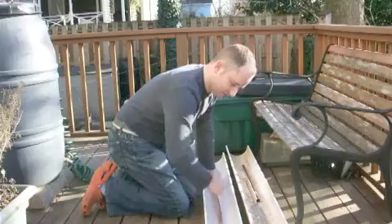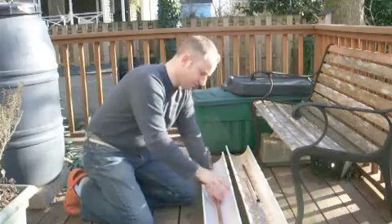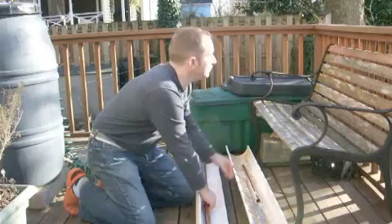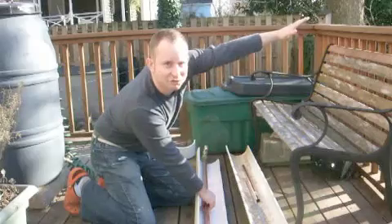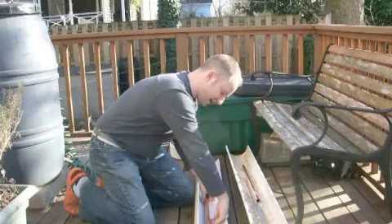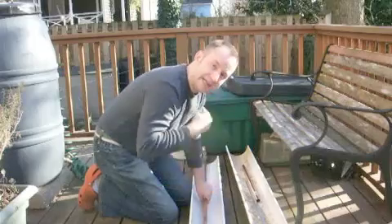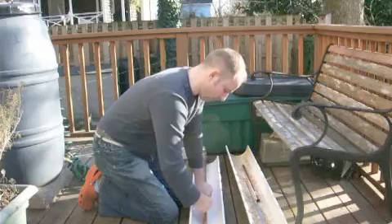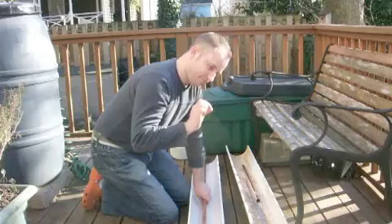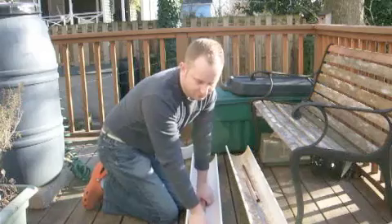This is actually intended — once this has been mirrored — so that when it's sitting in the bottom of the trough, the sun's rays come in from different directions. East and west, with the trough pointing south at about 45 degrees. Even so, the sun makes an arc in the sky. Right now it's late afternoon in Atlanta, so the sun is fairly low. As rays come in at various angles, it turns out there's actually a plane normal to the cross section of this semicircle that is most likely to collect the solar radiation from these different angles. That's the idea behind this element shape.